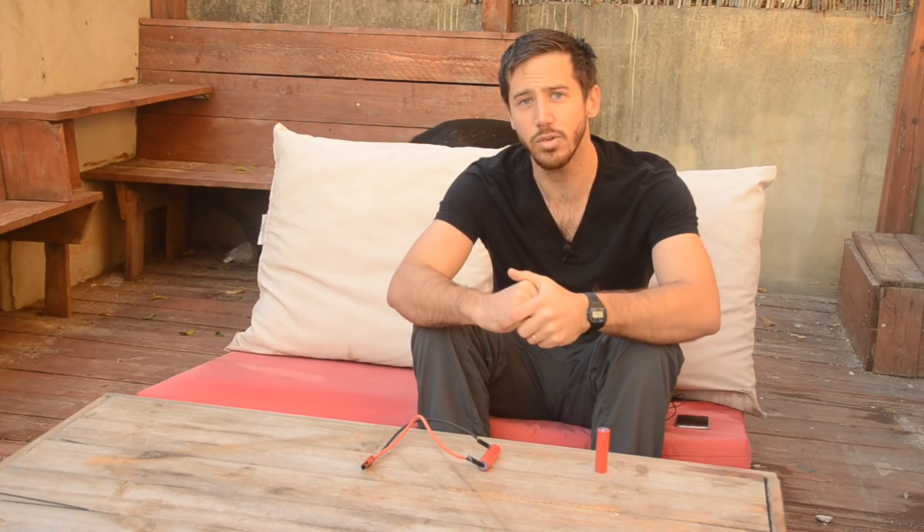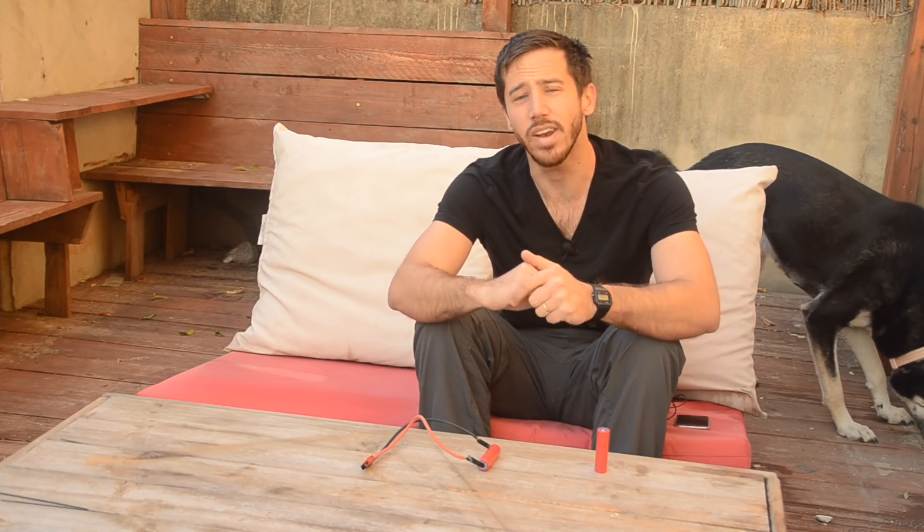So it's not exactly a continuous current, but it's going to be very close. For example, in the 4 amp test, the current's actually going to start at about 4.5 amps, and then end somewhere at about 3.7 or 3.5 amps. So I'm going to call that approximately a 4 amp continuous, but really it's ranging from about 4.5 down to 3.5 amps — we're really taking the average.